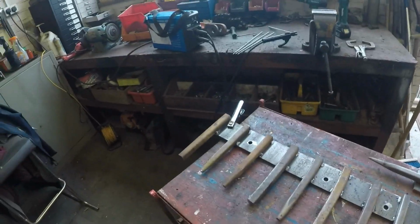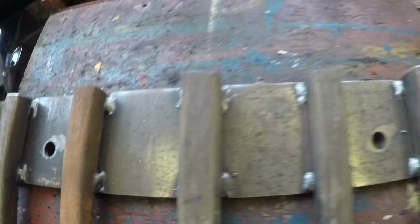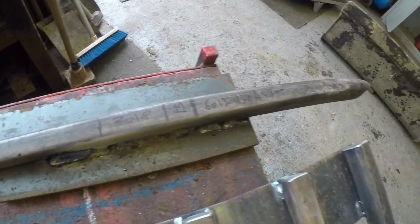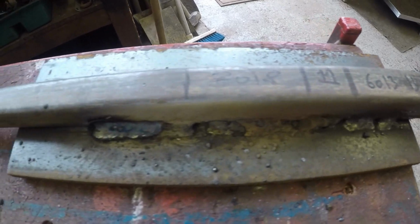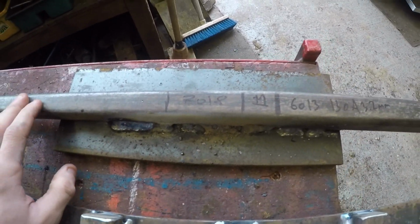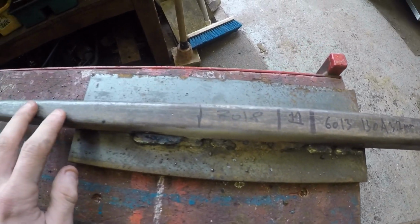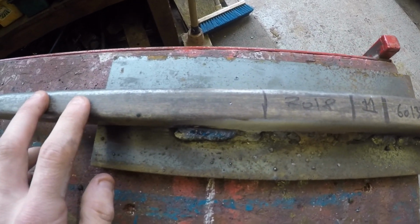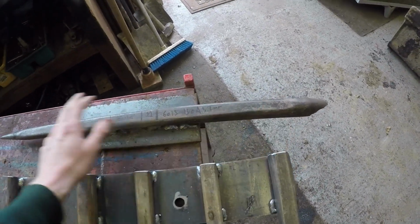Okay, so I've just got set up to weld them up. As you can see, I've just got them tacked at the moment. This is one that I had spare, so I used it as a sort of test to see which rods work best on this steel, because these tines, I guess they're hardened and then tempered, so that obviously they don't bend. But that's the normal length of them. It's a muckfork tine off the 6610 at work.